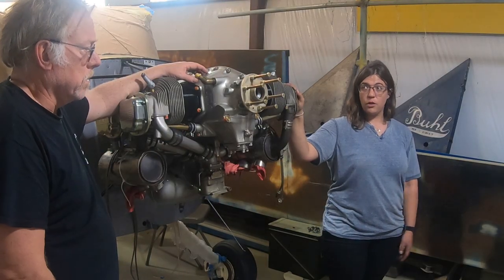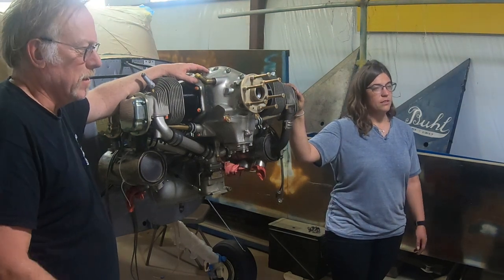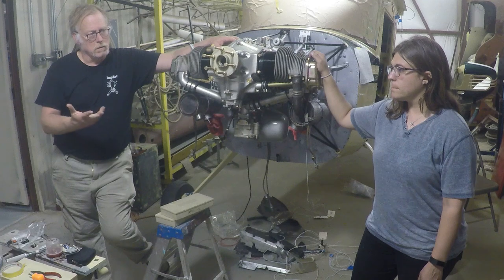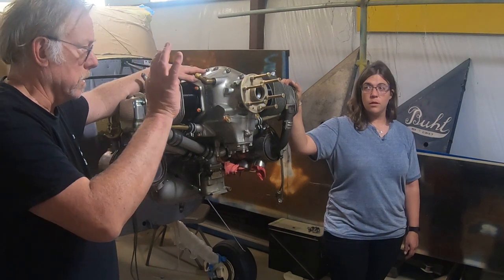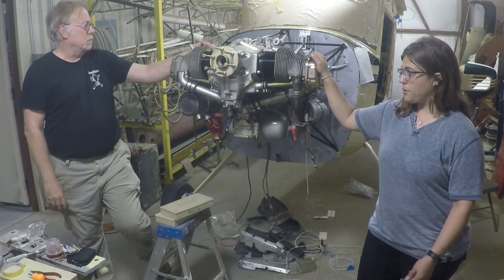Cotter keying it was probably the hardest part. A little bit of a struggle. Long day. Nothing lines up. It never lines up on torque. Ever. So then the alternator is ready to go in. Three bolts. And it's actually easier than putting in the Delco Remy, the original one, because you can actually get to the flange. And it's light, so you're not dropping nuts into the engine.